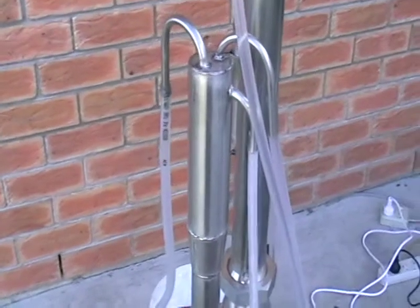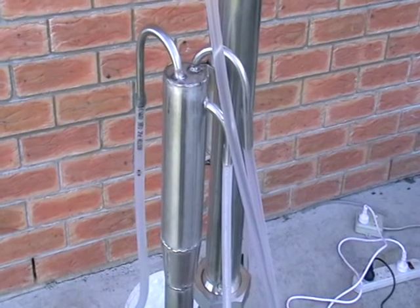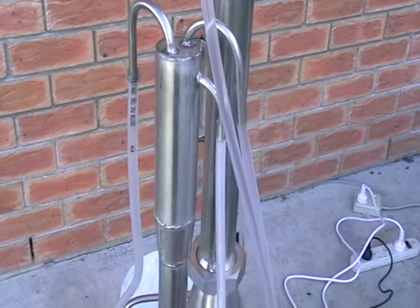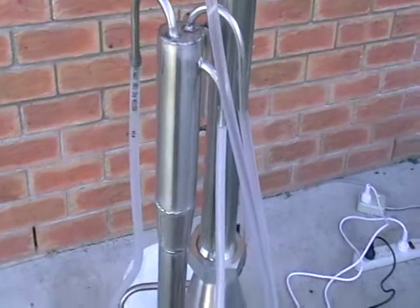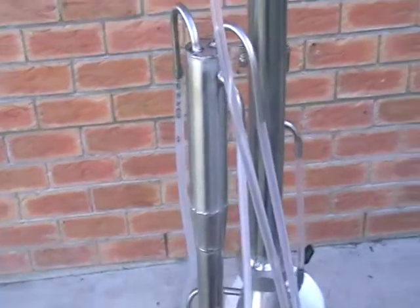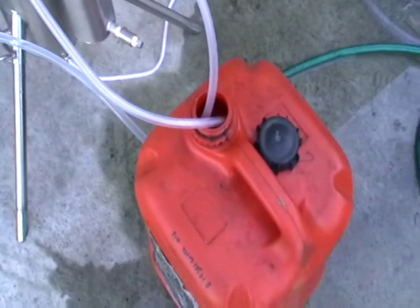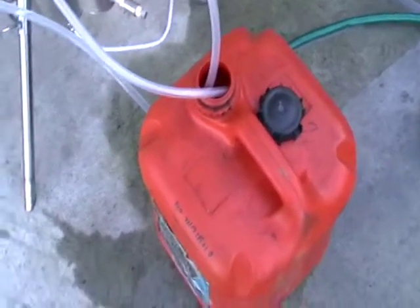Back here, the second tube is a tube that actually connects the actual system with the atmosphere, so there is no overpressure within the steam generator. It acts like a bypass in case of extra pressure or something, so it's always breathing. It's just dropped into the barrel for the waste water, so it doesn't matter — all the condensation can go there, no problems.